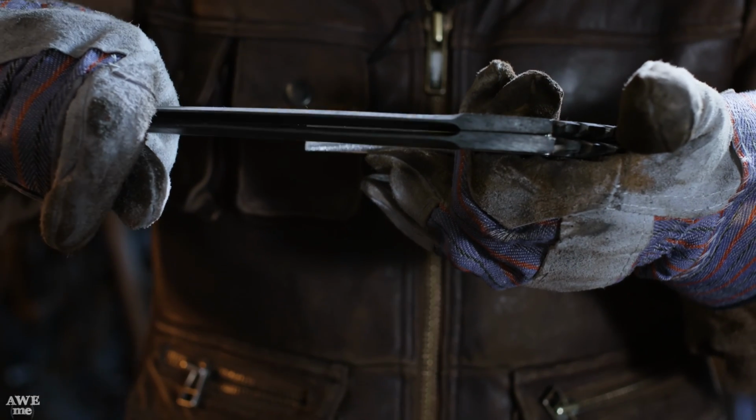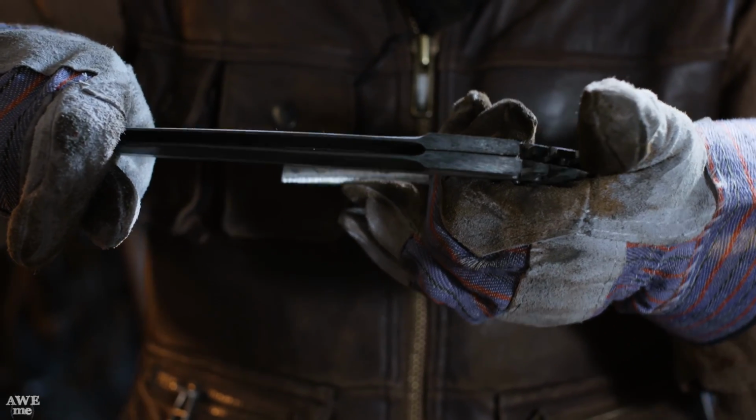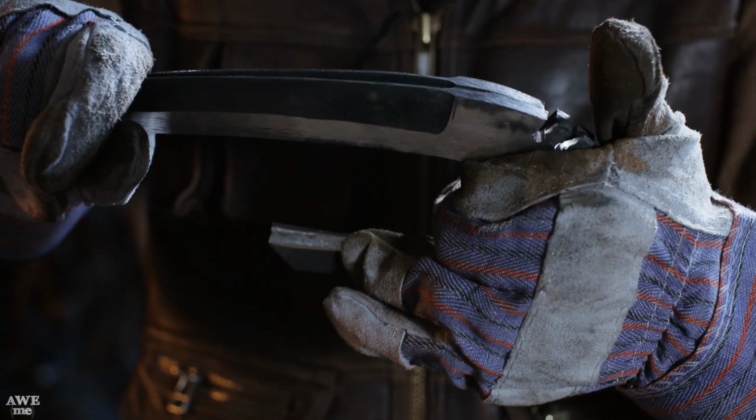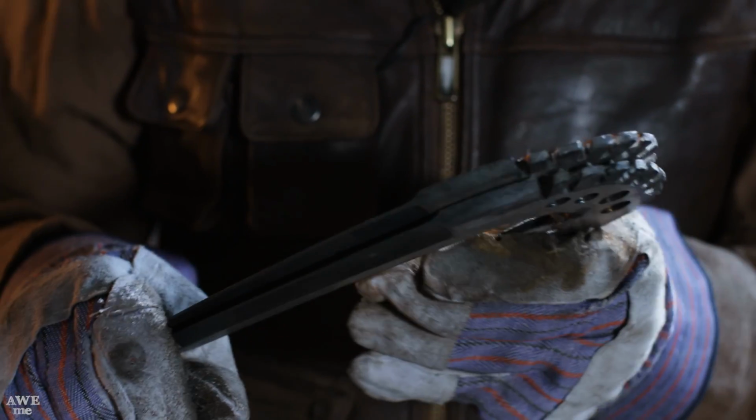Let's take a look at the plunge grinds. Say they're pretty on point. After heat treat, we'll be able to adjust the geometry just a little bit, but I'm really happy with these. Gonna be pretty wicked in the demos.